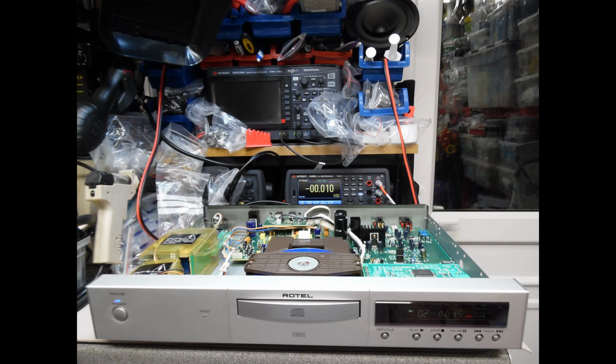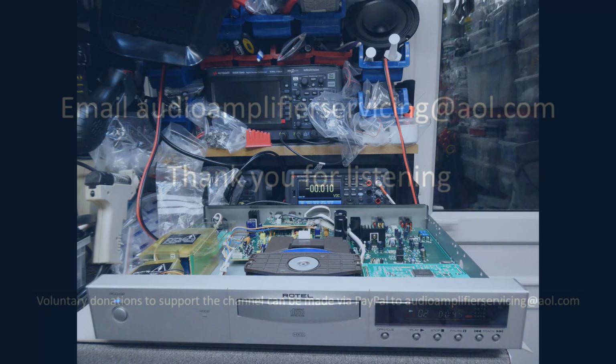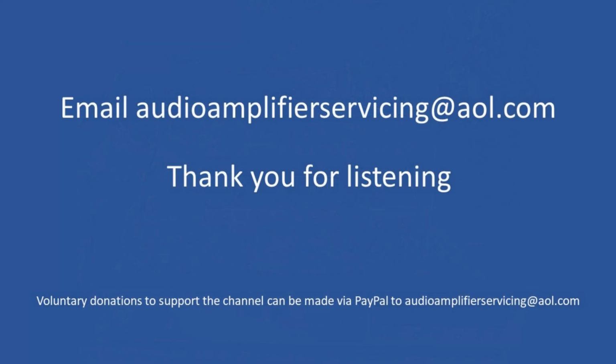You could maybe attempt, and I've seen this done before, where you try and rejuvenate the vacuum fluorescent display by applying a higher voltage across onto the grid lines. Maybe you might be lucky, but you could maybe over apply the voltage or current, which could then result in the display failing completely. And as they're not available as a spare part, you would also question whether or not you wanted to take that risk. So this being rather a short overview, that sort of brings us to the end.